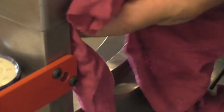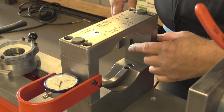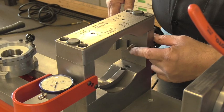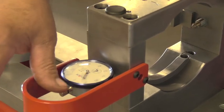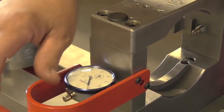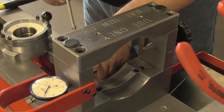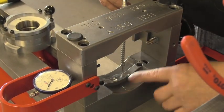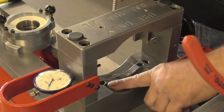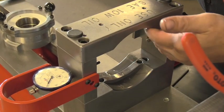The upper area is the same. While you have the bearing cage out, you'll want to check the condition of the dial shaft knob assembly. Make sure this plunger is free and springs in and out properly. The same with our dial indicator — make sure that that moves freely. We'll take some of our straight 10 weight oil and we'll put a little bit on the radius area. It's a little tough to get to on the top, so we'll put that on the finger and lubricate that area.